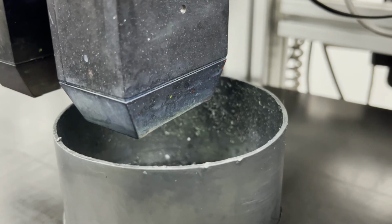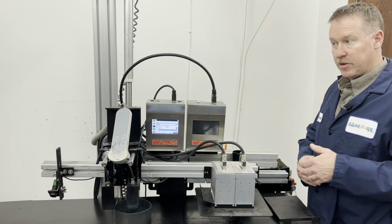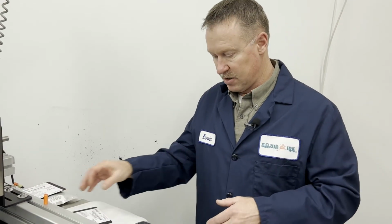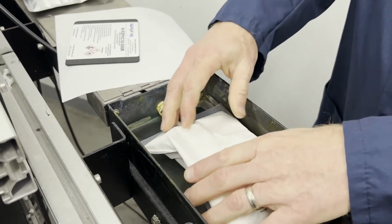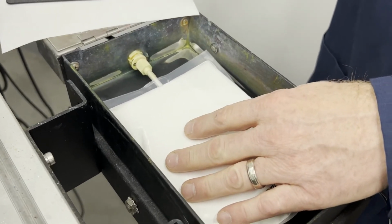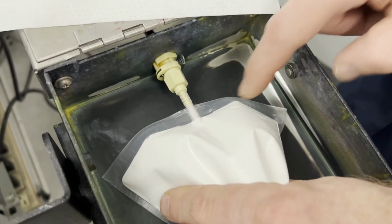At that point, you stop applying the pressure, and you gently wipe the bottom of that print head face with a lint-free wipe supplied with your system. One thing you do not want to do is remove the pressure plate and start squeezing this as if it was a wash rag in such a manner. This action can feasibly apply too much pressure to the faceplate and delaminate the faceplate on the engine, but you also are creating too much movement and stress points on your fittings and seals on the bag.